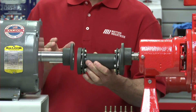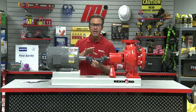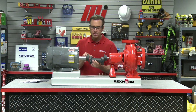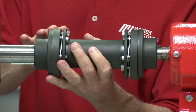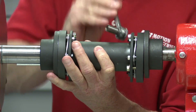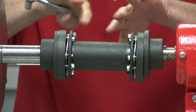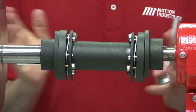We'll remove them before operation. We've compressed this so we can fit it between — you only want to tighten it enough to fit in between the assembly, because if you do it too much that compression can cause damage. As you can see, I've got this just barely enough — you can still hear it scraping against the side, so it barely fits in there, which is good. Now I'm going to loosen some of these bolts, which will release the compression, and you can see how it can now stand on itself. We do this on both sides.